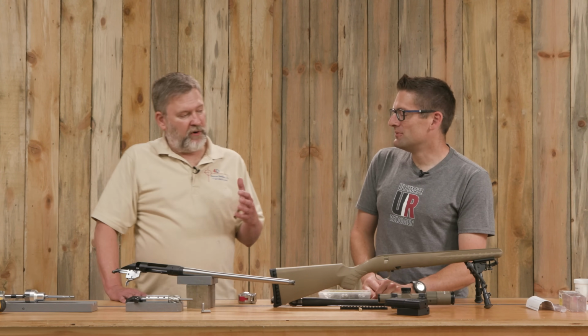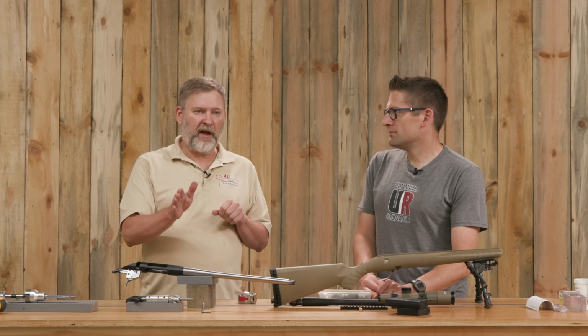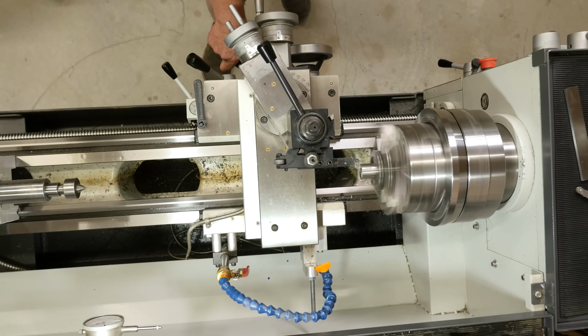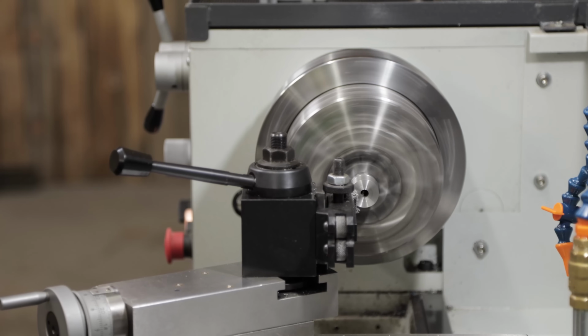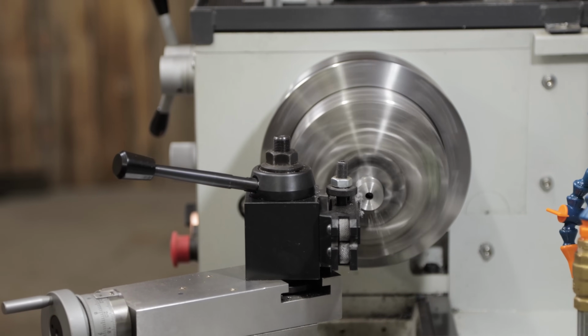So what we did at that point was, now we knew that the chuck was completely aligned, and the bore was going to be aligned to it. So we set it up and faced off the back of the barrel, which gives us a clean square surface to the bore, and it eliminates any damage that has been done in either the turning process or the manufacturing process, so that we're square and flat. That's where you could run your 60-degree cutter in the back to make it seat better on the center.